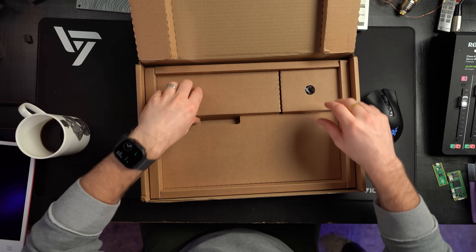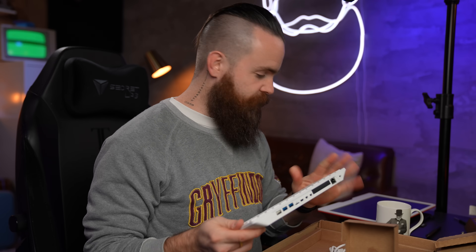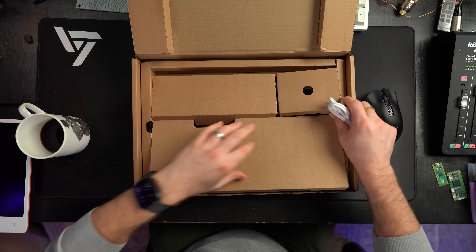In the box we also have a USB-C to USB Type-A cable. What's interesting is that the monitor should be able to be powered by the Raspberry Pi 500 directly — which is kind of amazing. It can also be powered by other Raspberry Pis, probably just the later models. When powered via USB from a Raspberry Pi, you do have some limitations: you can only go to 60% brightness and 50% volume, because there are built-in speakers. If you want 100% power and 100% volume, you'd need a separate power supply.